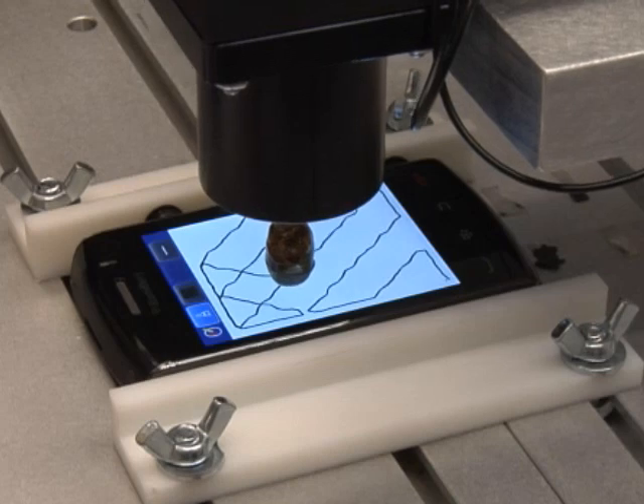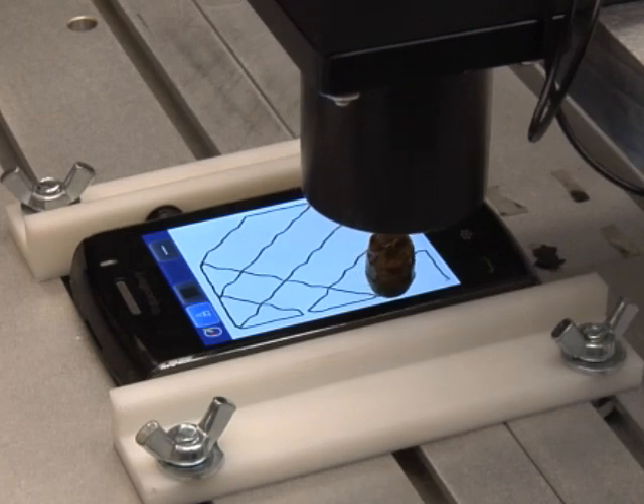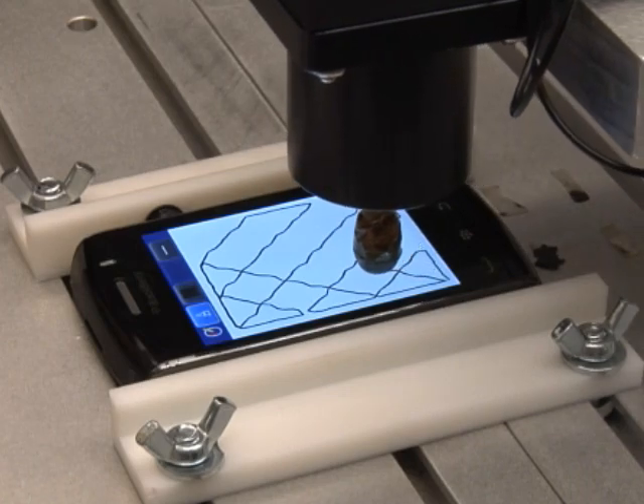When we're working on production devices, we use the most strenuous tests we possibly can to illuminate any possible tweaks that the touch sensor designer and manufacturer can incorporate to improve the performance of the overall device. Our robotic test finger is somewhat harder to sense than a human finger, and thus shows the holes in the performance of a touch sensor much more easily.